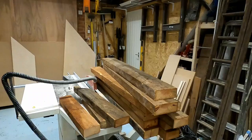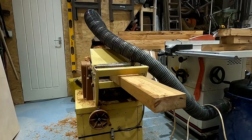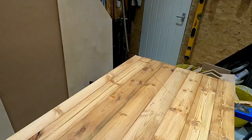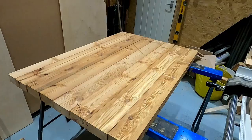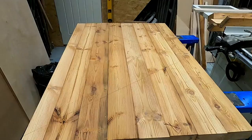I've got them all de-nailed — well, hopefully anyway. So I'll stick them all through the planer now and see what they come up like. I've planed them all up. I haven't gone mad planing them — I just want to get the sort of dirt off them, still keeping some of the character rather than making them look like new. You still want to see that they're reclaimed bits of timber, but obviously you've got to get them reasonably smooth so it can be nice to work on as a desk. You don't want to be getting splinters when you're sitting there typing at your computer.